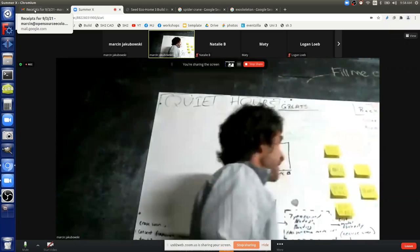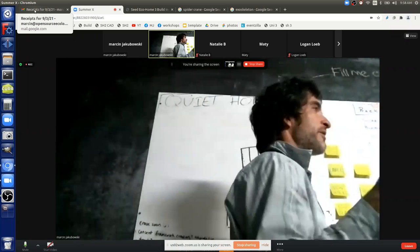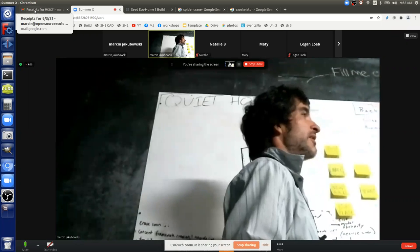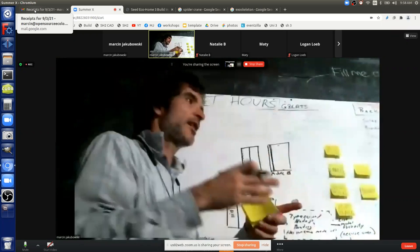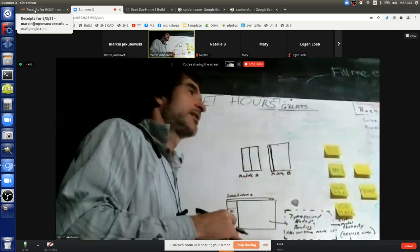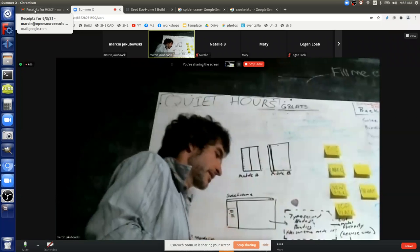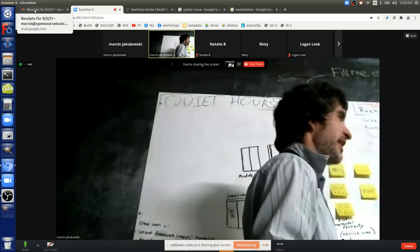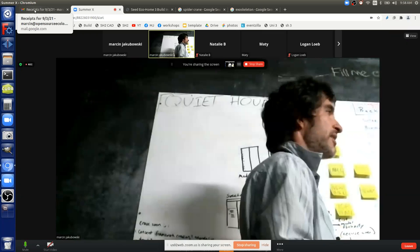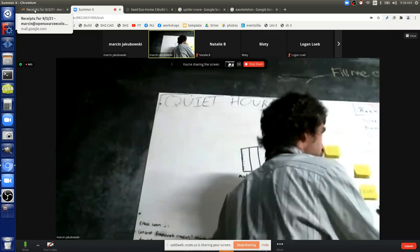So what do we have to assess for the top plate? A top plate requires staggering the edges. So you take a piece of 2x6. We've got a lot of 16s. You have to straddle so you're not ending up on a joint. That means if you've got a 16, then you've got 8, and how does this math work? You've got 8 and 8 left, but you can't do it. You have to split that 8 into maybe a 6, because of the edges. Yeah, so we have to do that. So maybe find a piece of 2 foot somewhere.